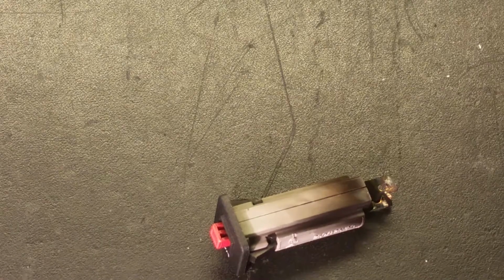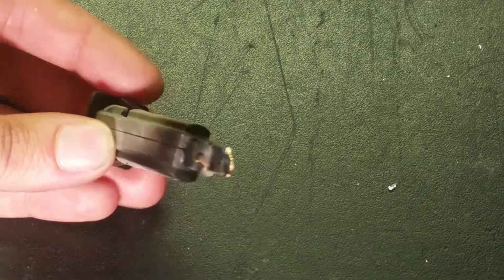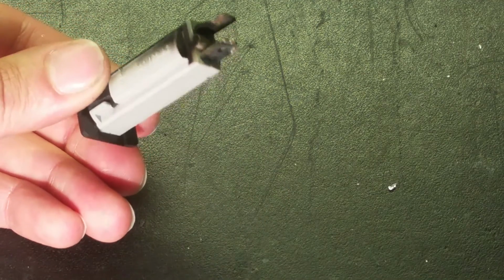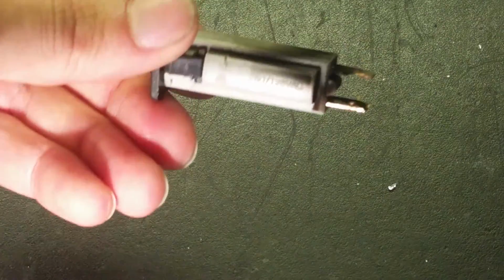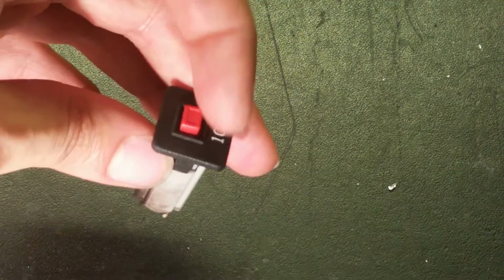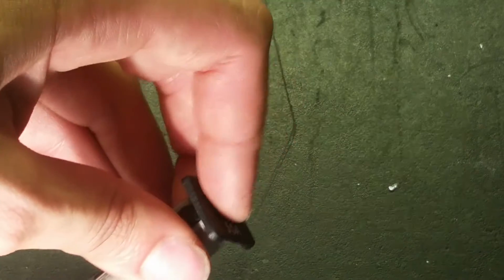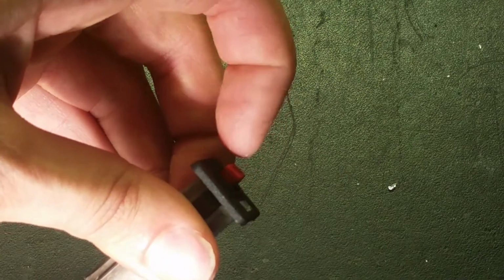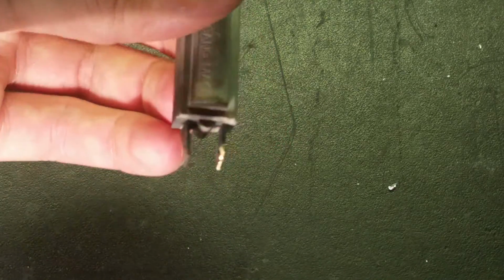And this one was the automatic fuse or circuit breaker. I think the contacts arced. It also got a lot of damage on the actual contacts. So we got bad contact there. It didn't explode, but actually it triggered open. So I'm gonna reset that. No, I can't reset that. It's completely blown inside. Let's do an autopsy.